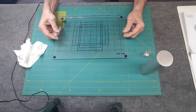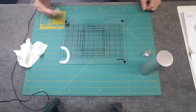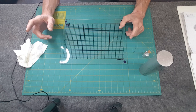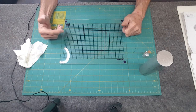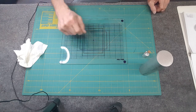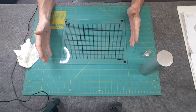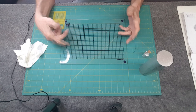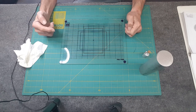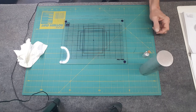It's super thick. I did some lapping on it already. I mean, this size, you can tell by this how big this thing is. They're cheap. And it fits an 8x10 piece of sandpaper nicely. I did some lapping on it, and then checked the surface I lapped on the granite plate, and it was definitely within half a thou. I didn't do a whole lot of long lapping, but if you're looking for something to put a surface gauge test indicator on to check some stuff at home, and you can't afford a big expensive plate, this is the way to go. I've seen them on Amazon and I can't remember some of the other places, but go check this stuff out. It works out really nice.